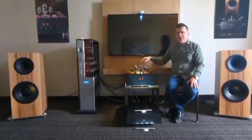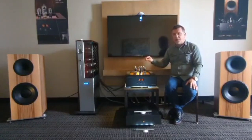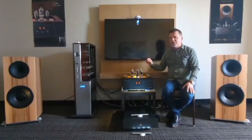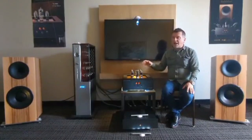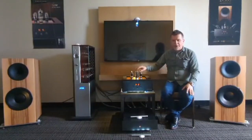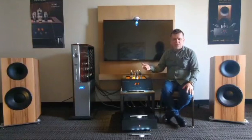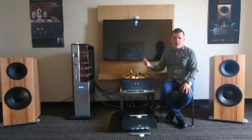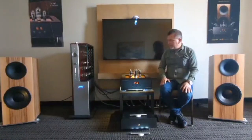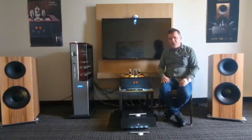tube types that can be fit here, and practically any tube except the highest amplification ratio tubes that are normally used in phono stages, those high amplification ratio like ECC83, 12AX7, they have amplification ratio of 100, which is too high here, but all other tubes can be used freely, and also the rectifier tube, which is an octal type of directly heated diode. This is 5U4G or 274B or GZ37, GZ34, and all the variation of the 5-volt directly heated rectifier can be used in this place. The synergy between your choice as a combination will give you the sound that you crave.